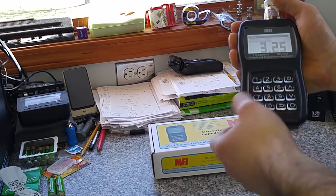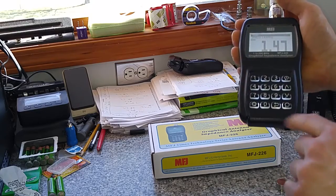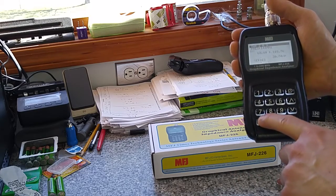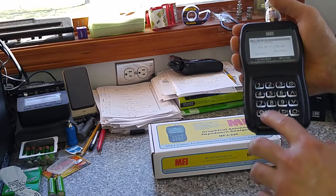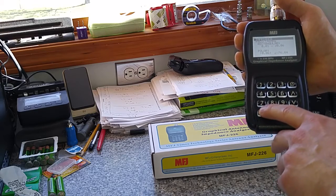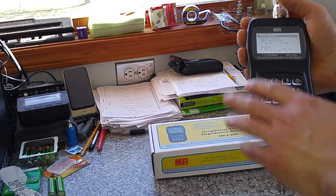The cool thing is, if you're well beyond the bounds, you can simply enter in the frequency you want and bingo. Going back to the single frequency plot, if you hit the gear or settings icon it gives you all the different options. You get the ZRX for reactance and stuff like that, series — all that. I'll bring it up to 146. You've got impedance, parallel impedance, rectangular and polar coordinates — very handy if you're doing manual paper charting, which this device actually eliminates. But if you want to check a certain frequency, sometimes I like to double check my work.